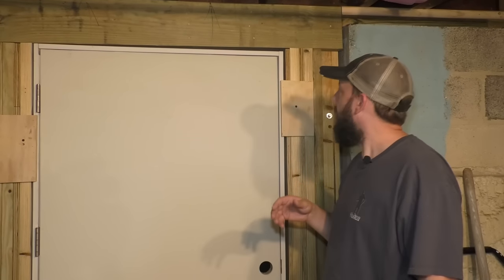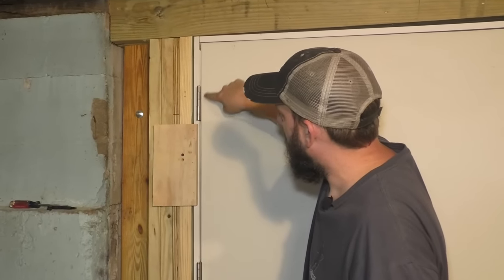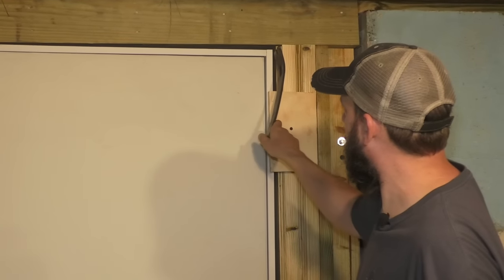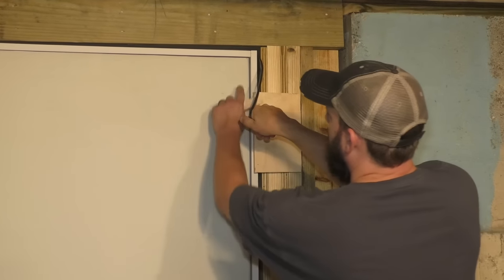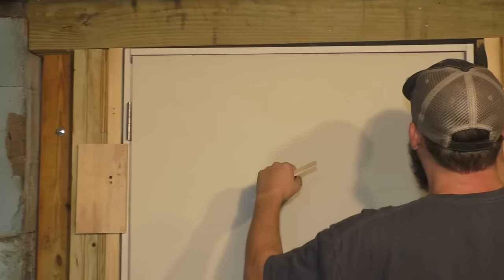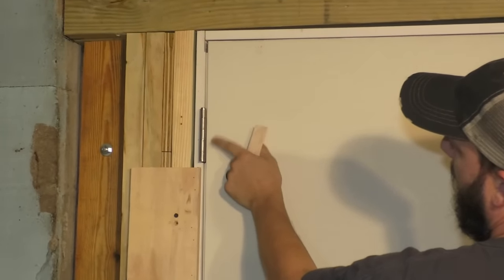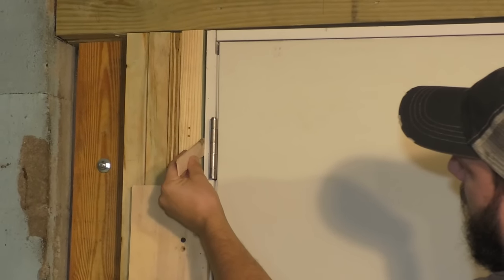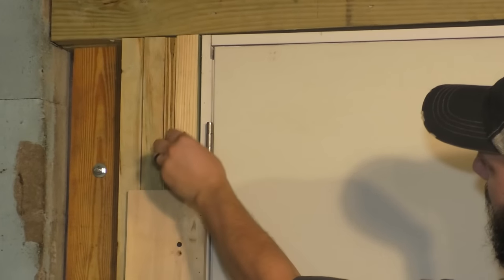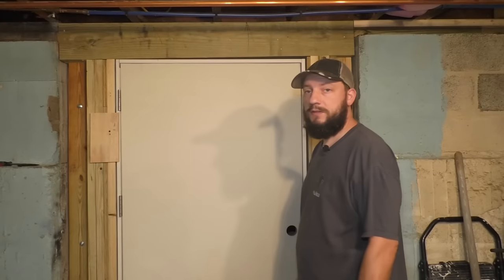Another thing I like to pay attention to is over here above this hinge — you can see below the hinge there's a gap right here, and up here it's pretty much tight with the door. I don't like how that is. So over here I'll put some shims in so that it brings this gap closer. I know that this gap has to get smaller, so I'll pull it this way. And if you look over here, what happens when I do that is that gap opens up a little bit. But the whole hinge and everything is moving too. So first I'll put some shims right here to stop that hinge from moving, and then you can watch that gap as I push that over — the hinge will stay where it is, and then above it will move to where I want it to be. So that's what I'm going to do now.